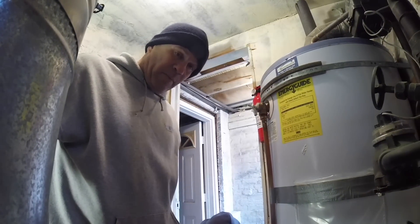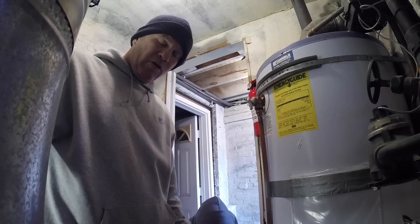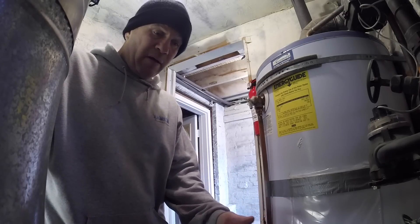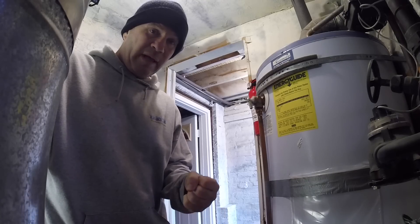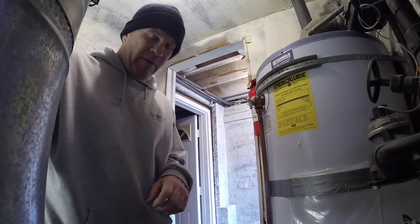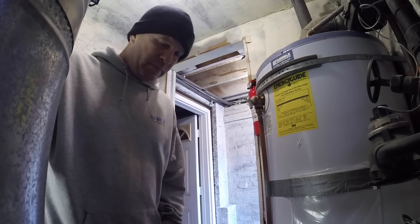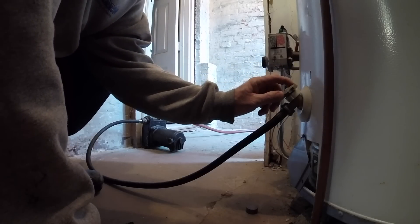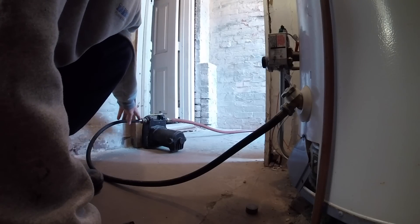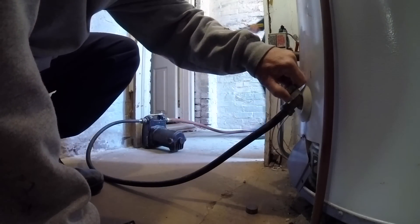The second tip of the day: when we set this pump, run the hose outside — you don't want it going on the sidewalk or open area that can be seen, because of the rusty water that will come out of the tank. We found a dirty spot behind the shed which will take the water no problem. Another point: when you open this up under water pressure it will also fill and prime your pump, so when you plug it in it doesn't struggle to get a prime.